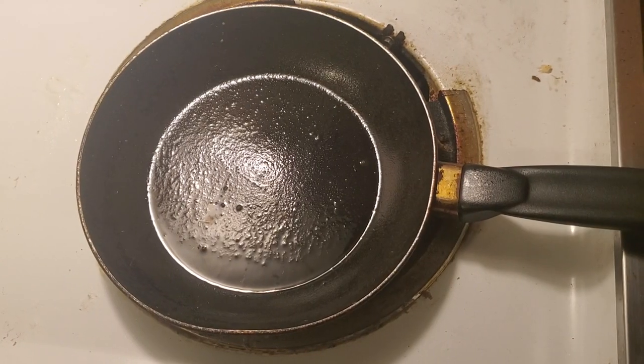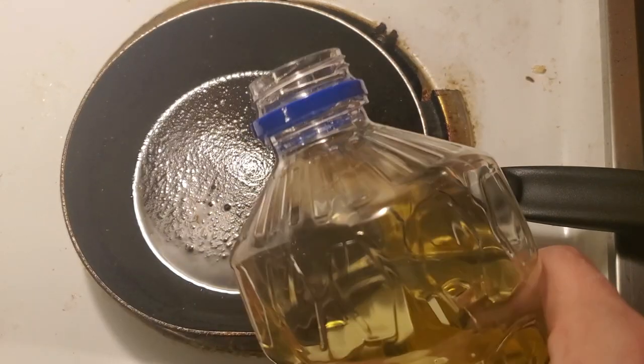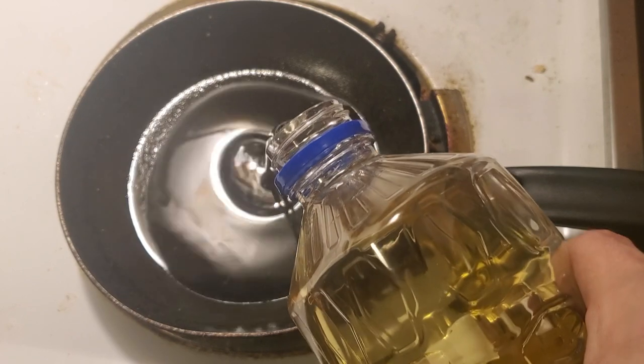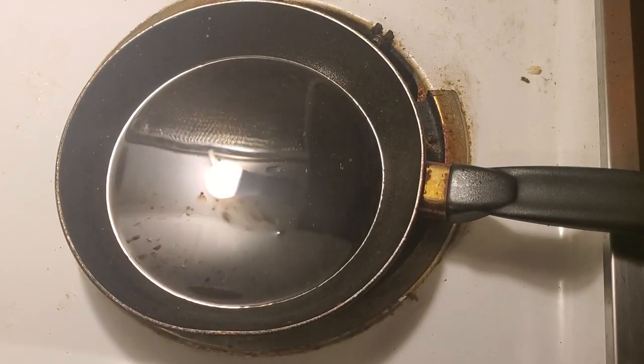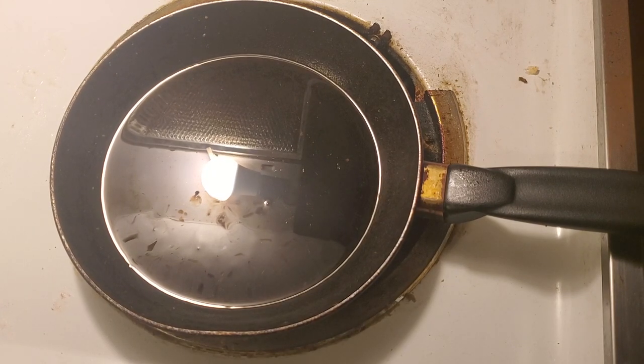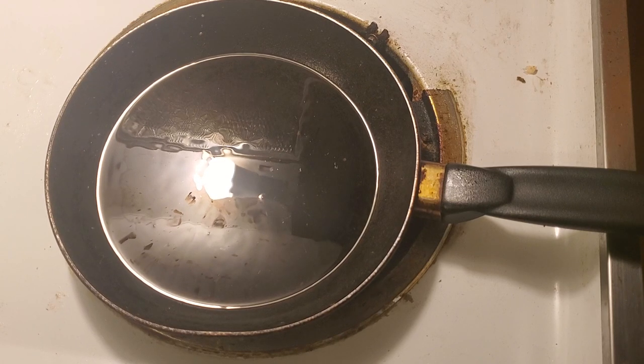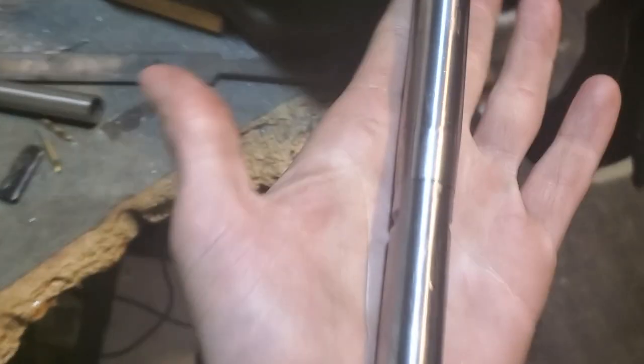I think the barrel is from Green Mountain. I'm not positive since it had no markings, and Apex didn't say anything about where it came from. But I do know that Green Mountain does make Galil barrels, and typically when you get a barrel and a kit from places like Apex, it's a Green Mountain. The barrel was already chambered with extractor cut and handguard retainer cuts on both sides of the barrel, weirdly enough. Why would they do that?